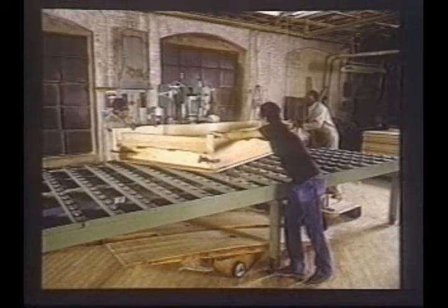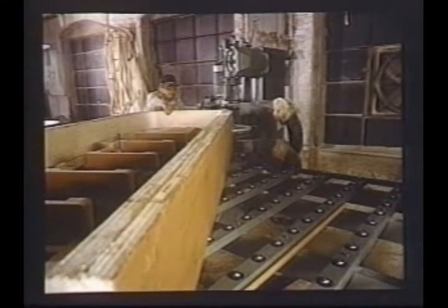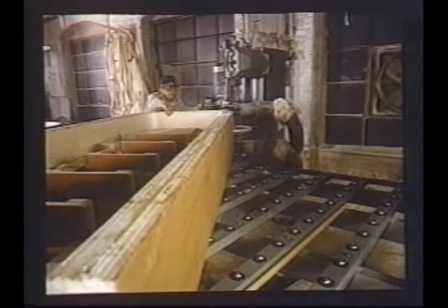After the rims are removed from the conditioning room, they are cut to proper height by trimming both the top and bottom. When this trimming operation is completed, a soundboard mounting surface will be prepared on the inner rim to permit a solid mounting of the soundboard without restricting its vibrating action. This will maintain a permanent crown in the Steinway soundboard for maximum and permanent tonal quality and projection.